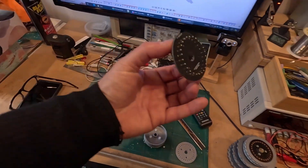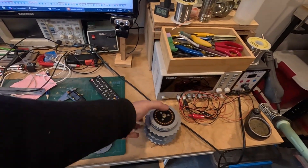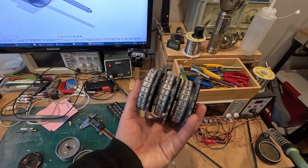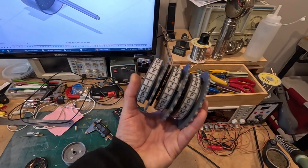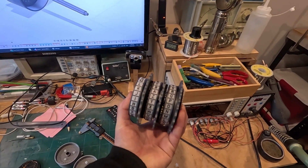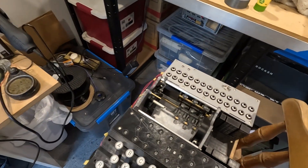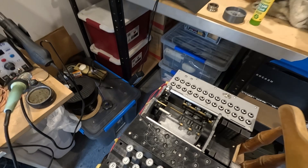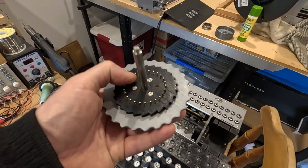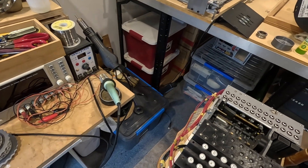This is just the reflector. For the machine to work you've got the reflector with 26 pins and then three rotors all with springy pins that need to be compressed down, and just the amount of force it's taking to do that is too much for my mechanism. So I either need much lighter touch pins or need to come up with a different way of doing it.